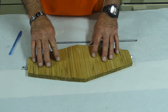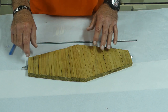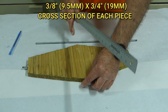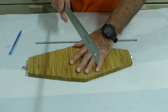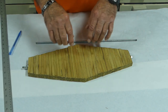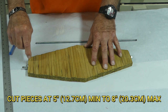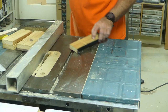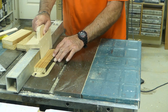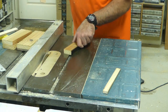To make a duplicate of this wind spinner you'll need to cut 42 three-eighths inch by three-quarter inch pieces. The maximum width is seven and a half inches, tapering down to about four inches on each end. The strips will range in length from eight inches down to about five inches to allow for trimming room. Set the table saw fence for three-eighths of an inch and make repeated cuts from shop scrap until you have all 42 pieces.